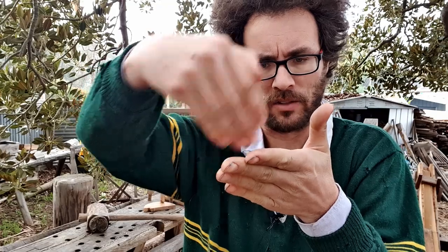With the rush, because I didn't know what I was doing — it was my first thatching — I basically started laying up one side, and then when it came to blending the valley I did a rubbish job. Because one side was basically done, I was trying to get the other side to feed onto it so the water would shed off. That meant a lot of water was dumping into one spot, and as you saw from the rush video, it just didn't go well at all.